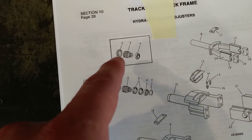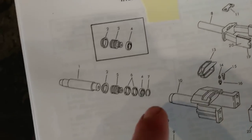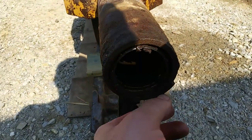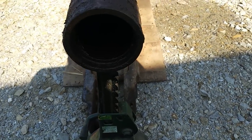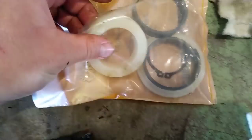This is the breakdown of how it goes together. The later ones have a couple of guide rings. My piston has a scraper seal and is in the cylinder — number three in the book is a piston without guide rings, and down here is the seal with no snap ring like on the later models. The scraper sits out here in the cylinder — I just dug it out of the end of the cylinder. That pushes back into this groove here, so when you put this back together make sure you put it in the right direction. Same thing with the grease seal — there's a U-shape, solid on one side, with a groove on the other side. Make sure that groove goes toward the pressure side.